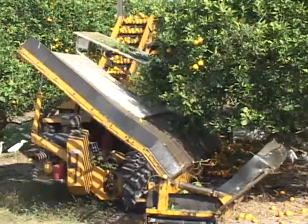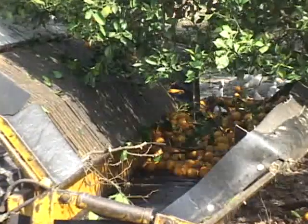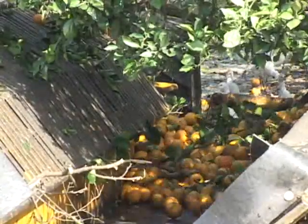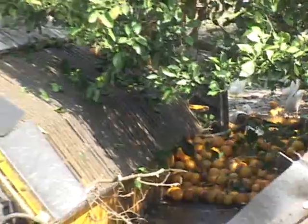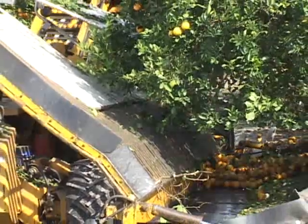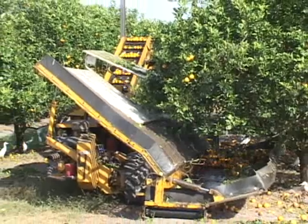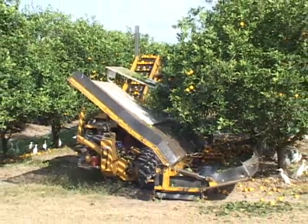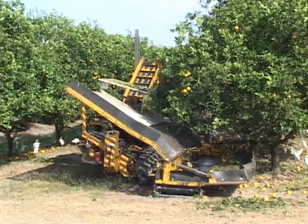The receiver unit will typically clear off the conveyor belt before leaving the end of a row. Here you can get a better look at the trunk and skirt height requirements and why they are needed. Note how the fruit moves up the conveyor belt to be emptied into the cart being pulled behind the unit. You will see pieces of branches and leaves mixed in with the fruit. Most of this woody trash is being removed by blowers and brushes positioned along the elevator belt.